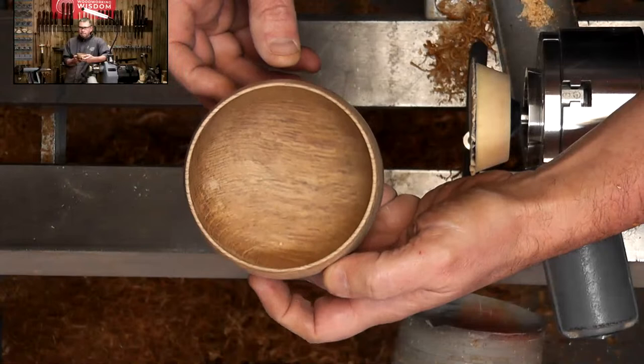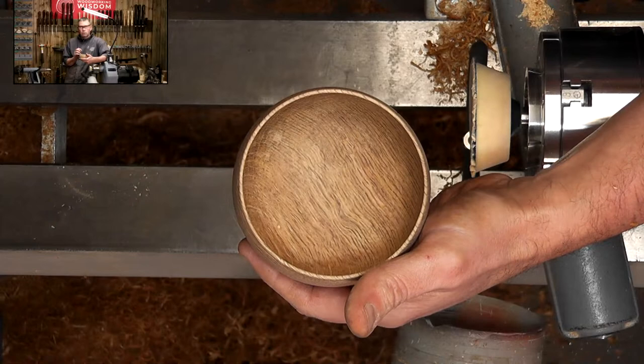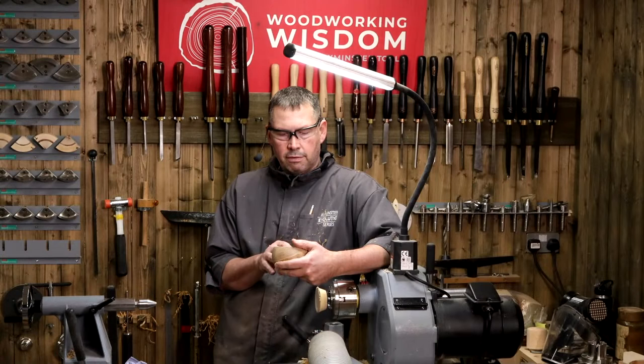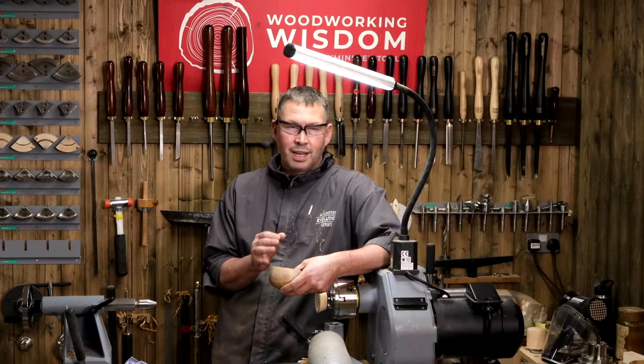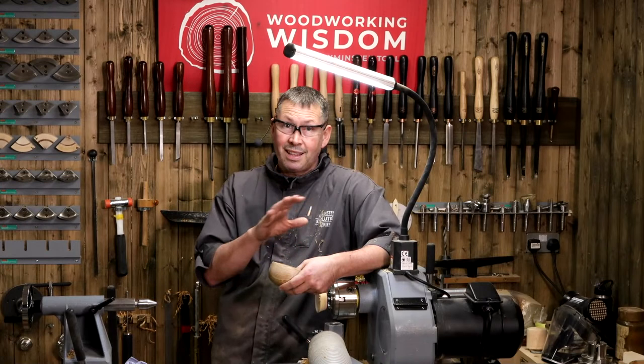All right. All good. One thing I haven't mentioned, but I want to mention it, is that oak isn't the only material, of course, to have high concentrates of tannic acid. So there are other timbers out there. Use one of them, and you'll come across colors in them that are really striking, purples and mauves and blues. That's because they've been in contact with either a barbed wire fence, a nail or a bullet or anything like that that reacts with the acids.